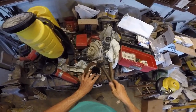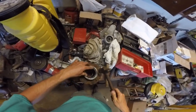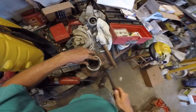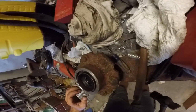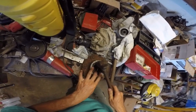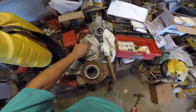Apparently this hub is the more abused one or something — obviously, because of all this wear. The smaller race for the outside I was able to push halfway in by hand. And I've got to say, this is rather nice. Since there's not as much material here, it's easier to tap this larger race in. Is that all the way in? There's a groove worn in there from when it went out — that's not supposed to be like that. Feels like we're hitting bottom. Fingernail test — I don't feel a groove I can get my finger in, so that's good.